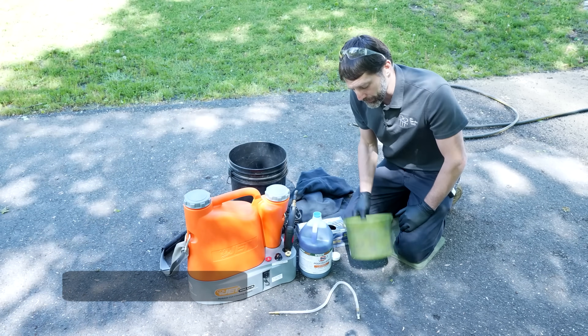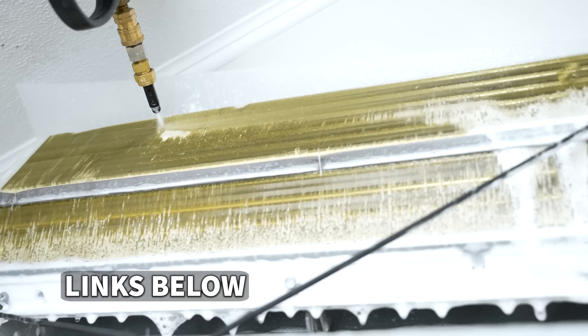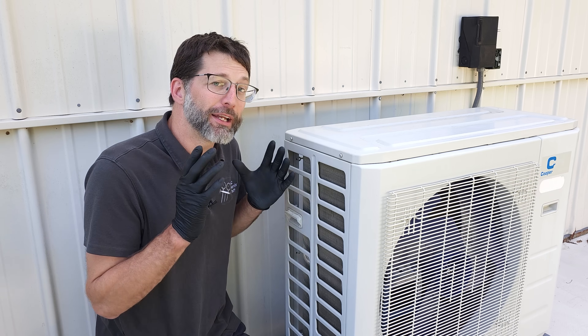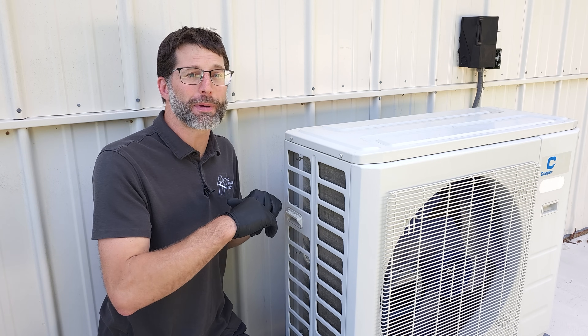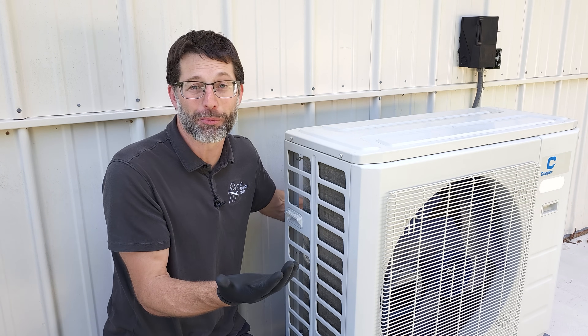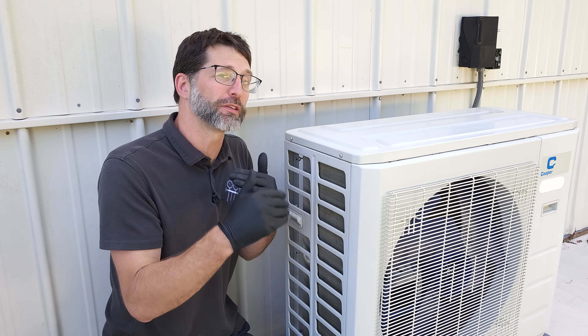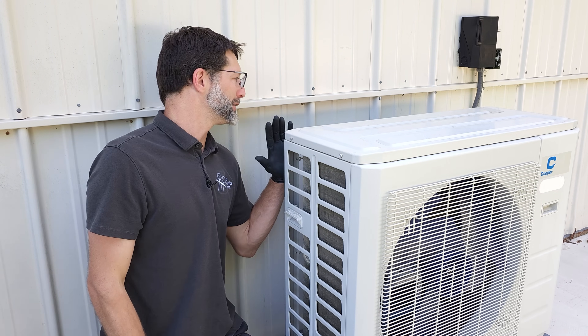You can watch another video linked in the description below that covers blower wheel cleaning, indoor coil cleaning, and outdoor coil cleaning. Cleaning the coils on a mini-split is not just about gaining efficiency or heat transfer — it also needs to be done for the system to work properly, especially if you have a lot of dust collection.